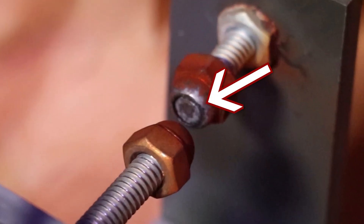Primary capacitor: larger than resonant for the neon sign transformer. You don't want the capacitors to form a resonant circuit with the neon sign transformer — that's how you kill your transformer. It's in the guides, look it up. Primary coil: you want the inductance of the primary coil to form a resonant LC circuit with the primary capacitor that has the same resonant frequency as the secondary. Cone or pancake shape preferred — equations are in the guides. Terry filter to protect your neon sign transformer — it's in the guides. Spark gap: smooth rounded electrodes that can take a beating because they get very hot. Gap size depends on your transformer voltage; start small and work your way up incrementally. Don't go too wide or you can kill your transformer. With the static gap you also need some kind of airflow to quench the gap, otherwise it won't shut off quickly enough — use a computer fan or something.